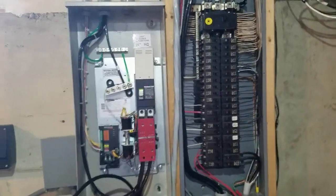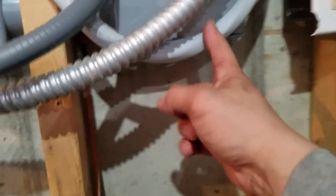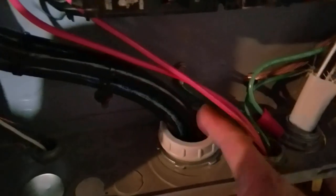Running our wire — we're continuing on, running our number two wire for our 200-amp main over here. It was quite a little challenging but fun. I started here, went down, took the wire, and actually bent it for a 45 and pulled it up through — it sucked right up in. Pulled it down here, same thing — bent to 90 and popped it up in there. Took a little bushing my buddy told me about, stuck it up in there to give a little spacer so it didn't scrape up the sheathing too bad. Kind of a little workout, but got the wires up there and taped the white one.